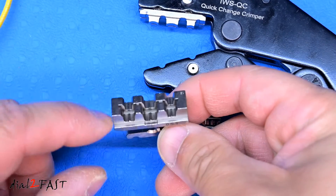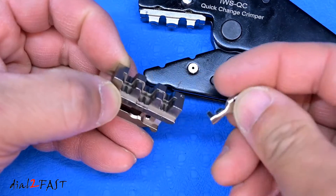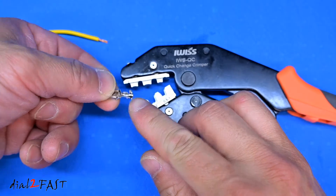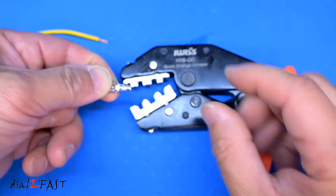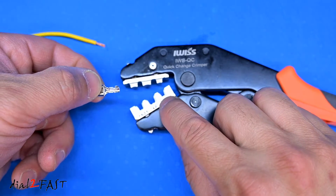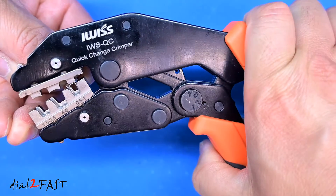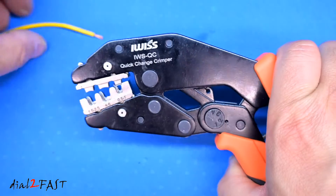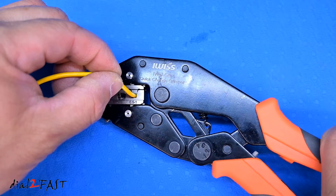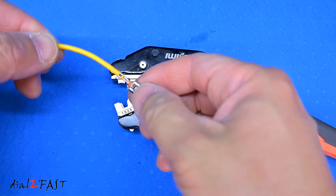I removed this die to show you it actually has two parts — on one side it has a wider opening and on the other side a more narrow opening. So when you're placing this connector into the die, you'll crimp both wings in one single action. With the two tabs on the connector, squeeze in a little bit, then place the end where it'll crimp down on the insulated part of the wire into the bigger opening of the die. Since it's a ratcheting crimper, it will lock in place. Place the wire into the terminal, squeeze down on the crimper all the way, then release. And right here is the completed crimp.